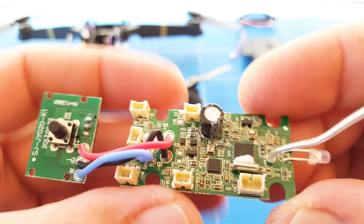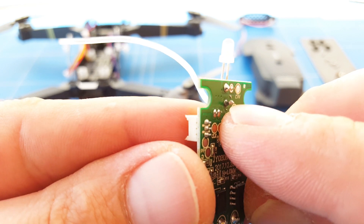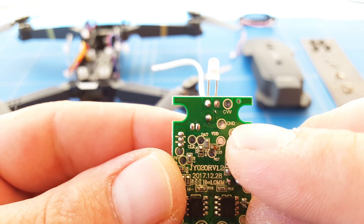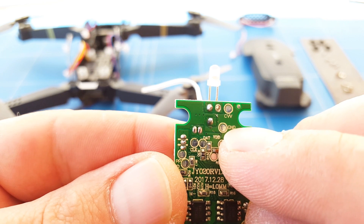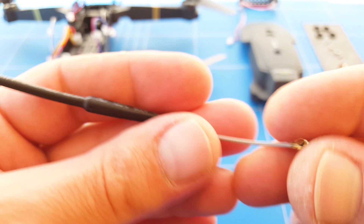You can see that the antenna is coming into the circuit board. Below the circuit board you will see the antenna connection point — this is where the positive wire from our new antenna goes, and then the outside negative wire goes to the ground pad sitting right next to it. Grab your new 2.4GHz antenna.